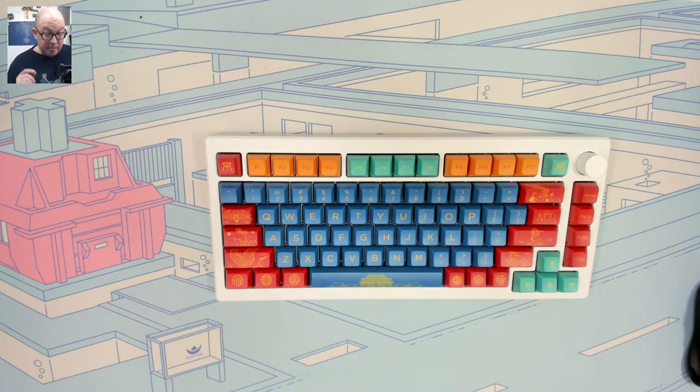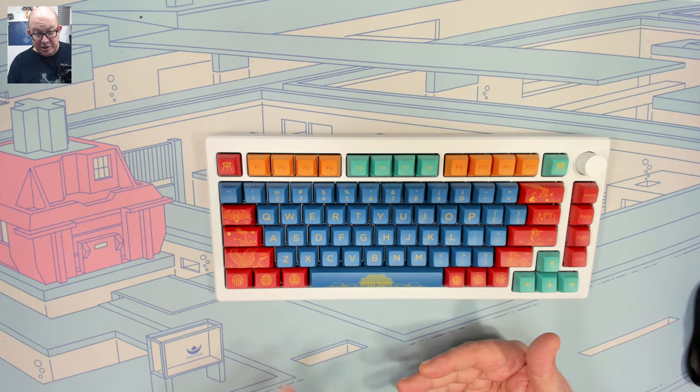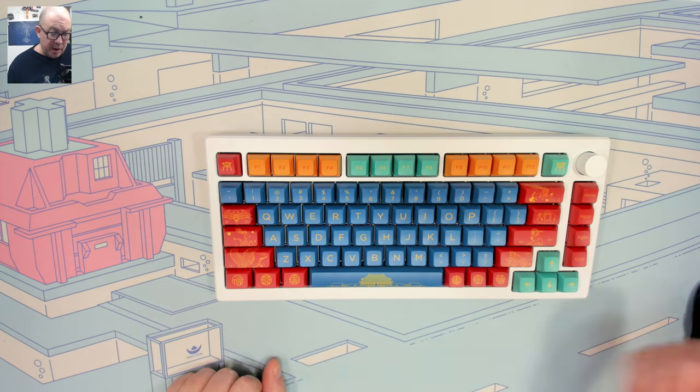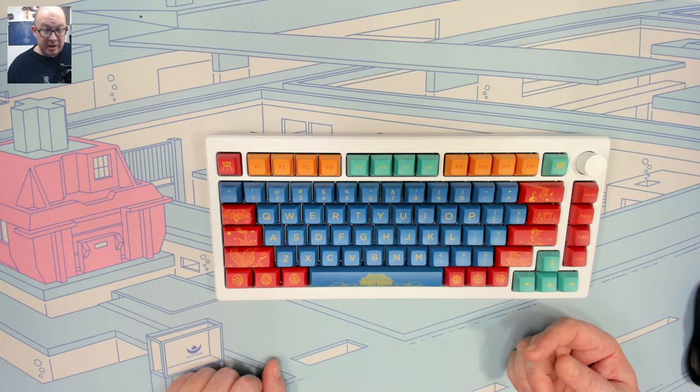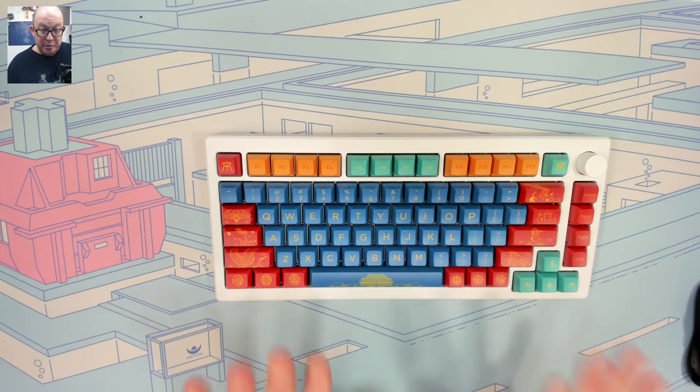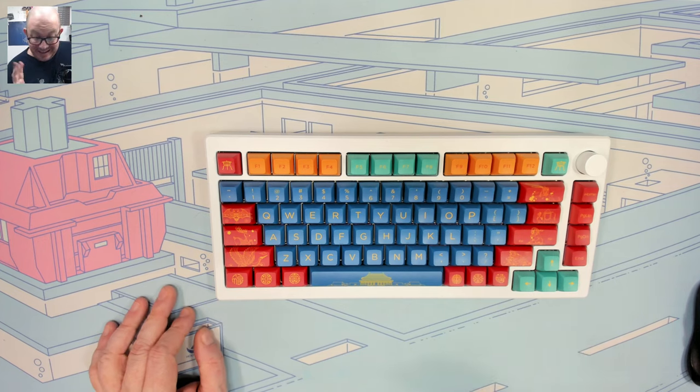Sounds great stock, but again, I'm going to come back to it. I'm going to probably replace the under-PCB pad with a sheet of PET and maybe some polyfill. I'll probably do a Tempest tape mod, I'll do some screw-in stabilizers, and I will probably do either a PET or LDPE plastic layer between the PCB and the IXPE to get that hi-fi sound.